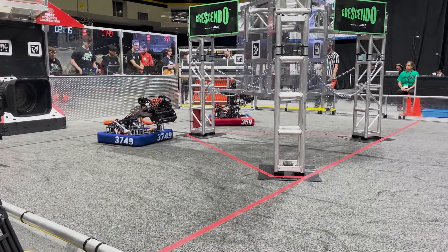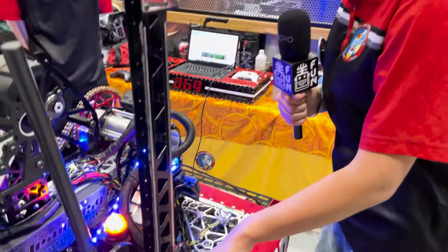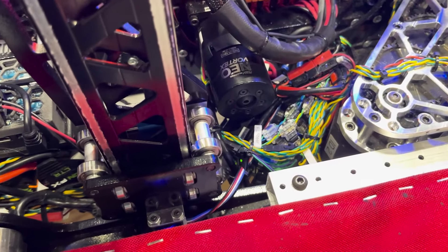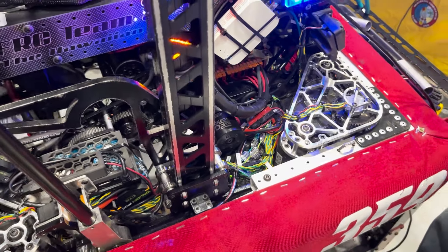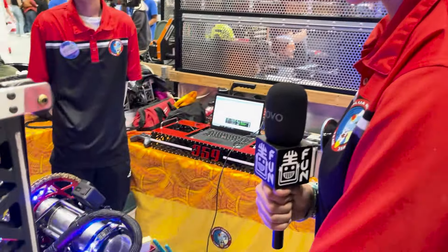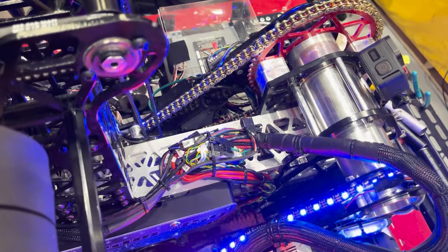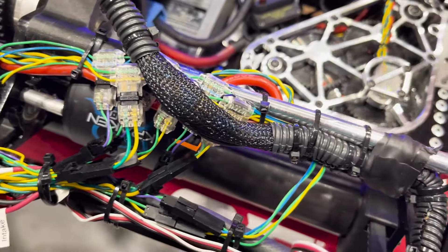One of the big things we wanted to do with our robot is make sure the wiring is as reliable as possible. We run two CAN buses — one in yellow and one in purple — creating a redundant CAN bus so we can always fall back on the other if something breaks and we can't take the time to fix it right away. We run that all the way from the bottom up to the top of the arm and into the intake, where vampire clips connect all of the intake devices to the CAN bus twice.